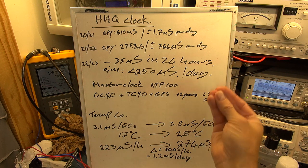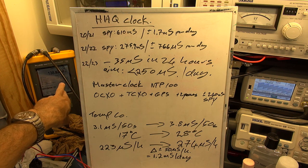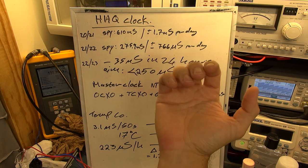In the background I've got the Fluke, which I can tell to gather statistics over a certain number of clock pulses or second pulses — you can set it for 50 or 100 cycles. What I do is set it for 50 or 100 cycles per second, then divide by 50 and multiply by 60 to get to a minute, then multiply again by 60 to get an hour. That way I can quickly work out how things are drifting and changing, particularly when changing temperature.